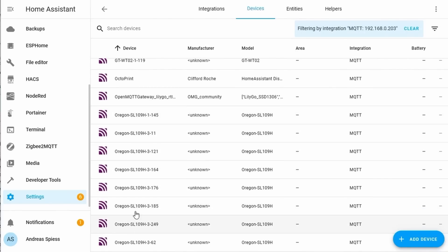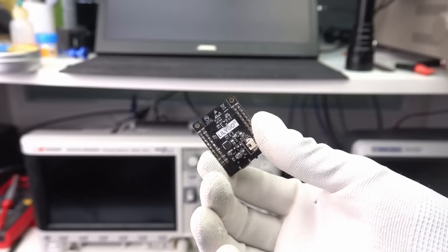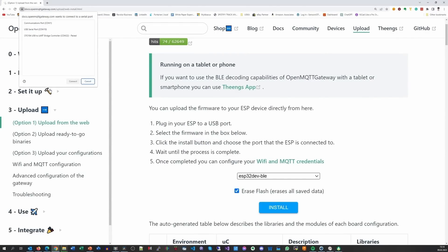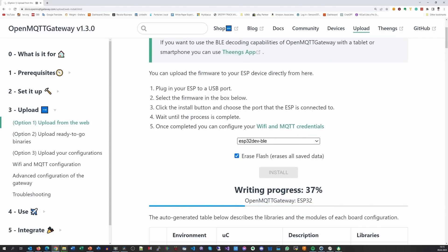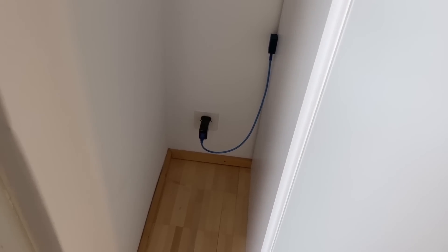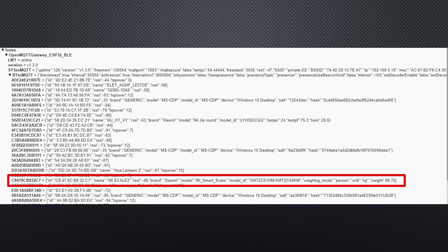This time, we do not need LoRa and can go cheaper and smaller. I use a Lilygo T7 Mini ESP32 board. We apply the same procedure as last time. Because we do not need any speciality, I use the standard ESP32 Dev-BLE board to upload. After entering the same data as before, our BLE gateway is ready. I even found STL files for a nice-looking case. I mounted this gateway in a close-by room because I had no unused power outlet in the bathroom — no problem, the BLE signal passes the wall without issues.